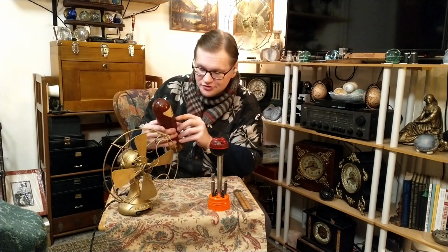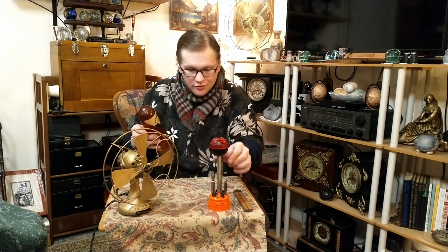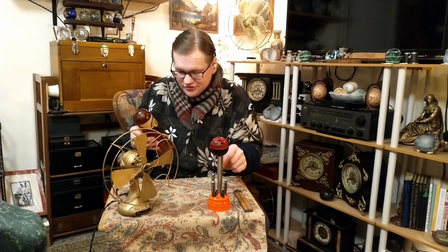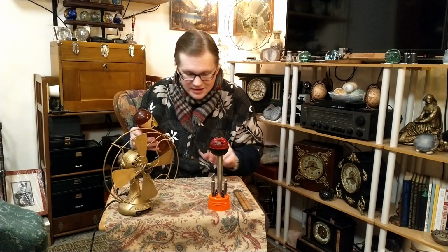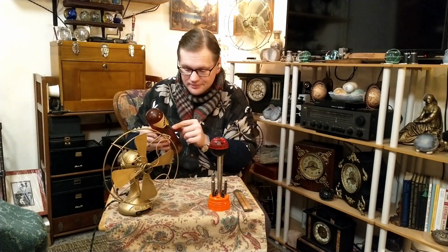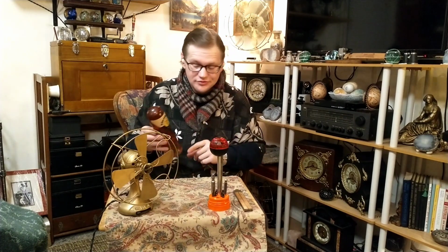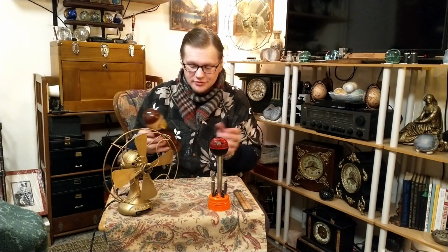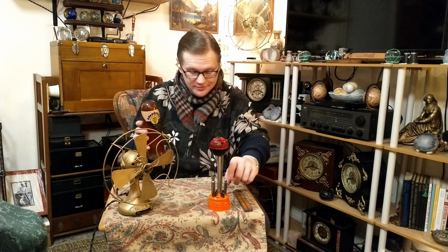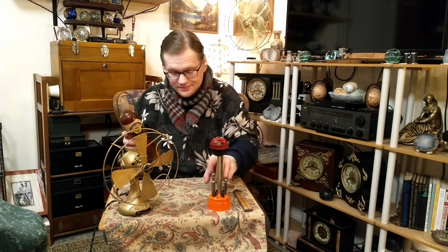However, the list shows part 202, which is an all-purpose drive shaft, which is this. 204, which is a 7-inch keystone, 3/8-inch tip flat driver. 302 is a number 2 Phillips. And I added a number 1 and a number 3 Phillips to the kit because it did not come with all those bits. It comes with 305 and 306 cabinet bits, which are just slotted screwdriver bits. They called them cabinet tips for a long time. And part 401 is a 1/4-inch socket extension right there. Part number 405, 3/8-inch drive socket adapter right there.